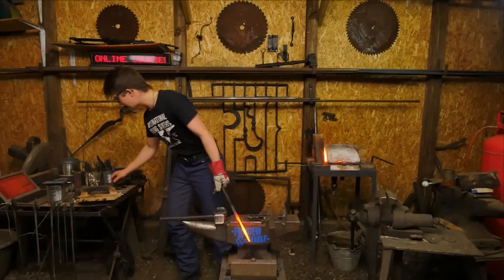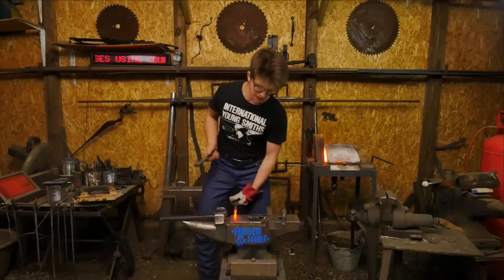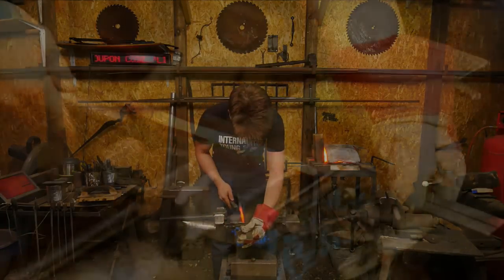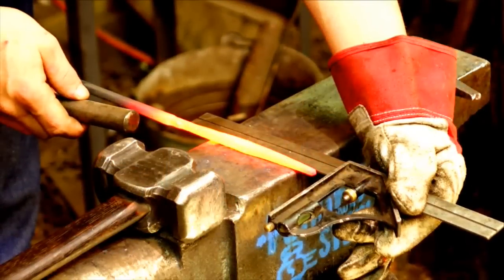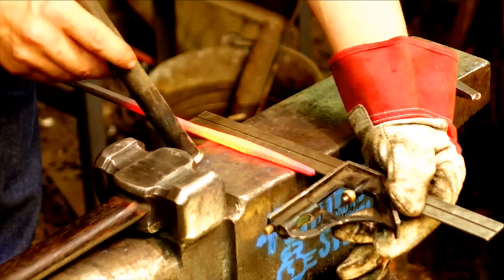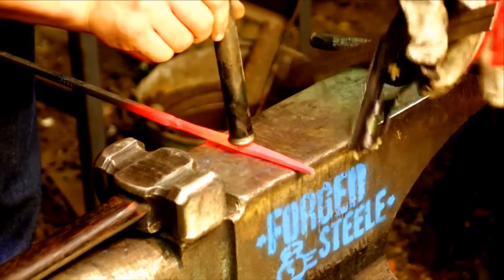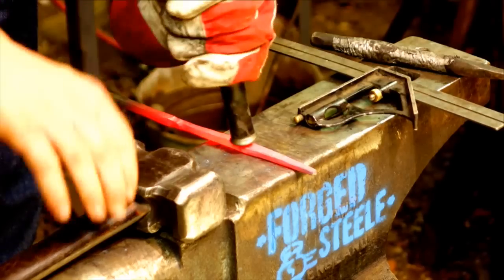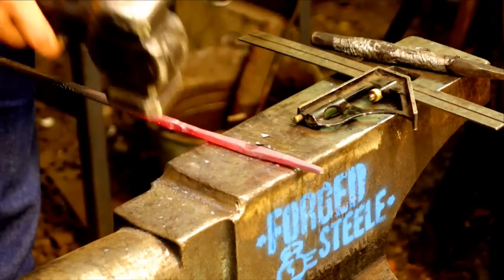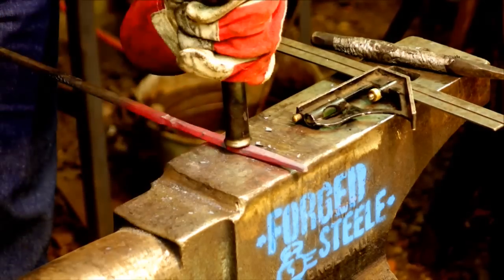So, first thing I think I'm gonna do, I reckon I'm gonna take myself a pretty big fuller, set that right in the middle of this bad boy. So Sam measured up the bangle that I'm currently wearing at 130 mil. I'm gonna give myself a little bit of fudge factor, and this right now is at about 140 mil. I give myself a little pinprick with this ball punch, and we're gonna lay that right in the middle of that bad boy. See if we can swell it out a little bit.